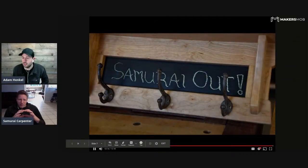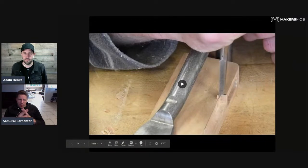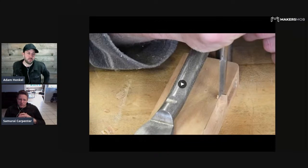How do you spell that? Odies. Odis. Okay. Oil, and you can get the original. I typically just use the original, or I recently ordered the Oxi Oil, which is like the original oil, but supposedly it darkens the wood over time, like oxidizes it naturally, so it gets a bit darker. So I'm trying that out as well. And then you can get wood butter. They've got several different things for different purposes, but just the universal Oxi oil is pretty great. At first I applied it with a rag, but I found that the rag was absorbing too much oil. So now I just rub it on with a latex glove, and massage it into the grain.